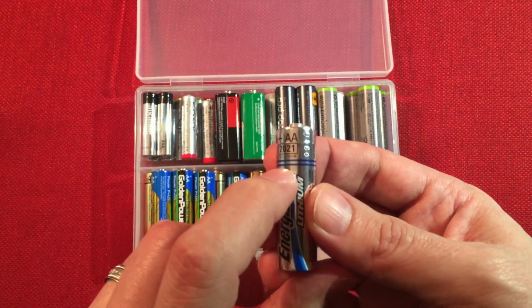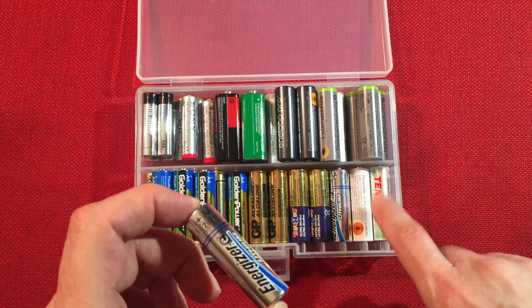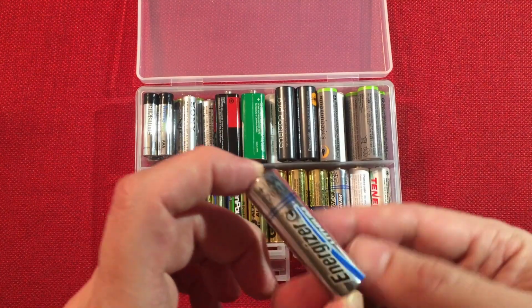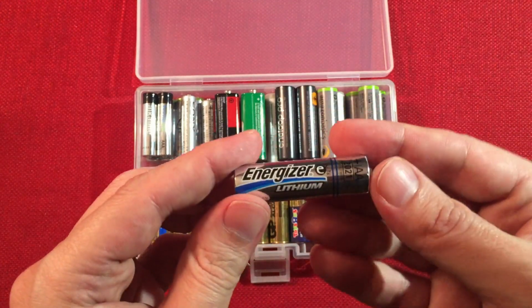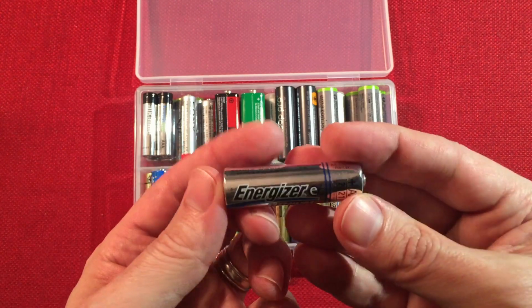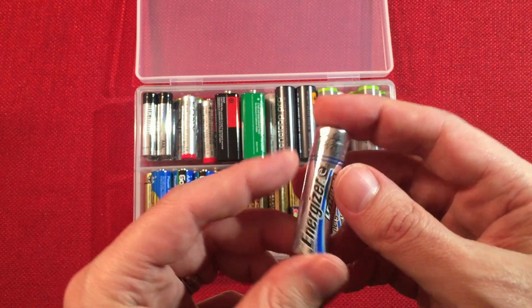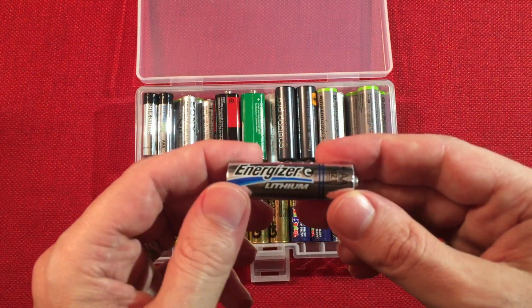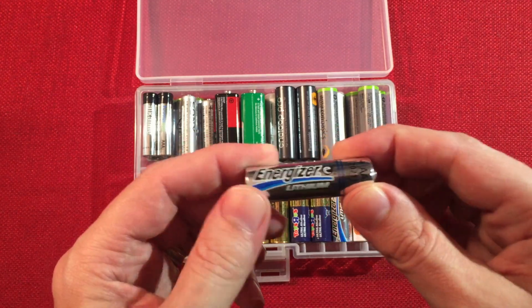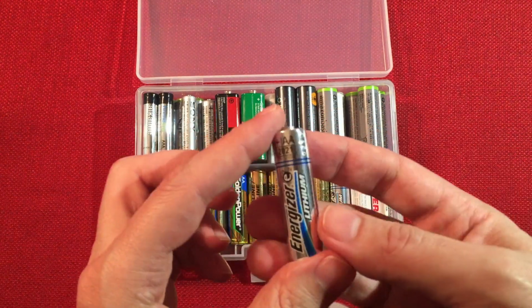And that means the voltage in these things, when you measure them, they're not your typical 1.5 or 1.3, 1.2 on those rechargeables. They're 1.75. And you add that up, say you got 4 cells in the radio, that's overcharging. Now, a lot of radios have a circuit that can stop an over voltage situation, but some don't. Like the Skywave. The Skywave explicitly states not to use lithium batteries in their radio. So I am reluctant to use these now.